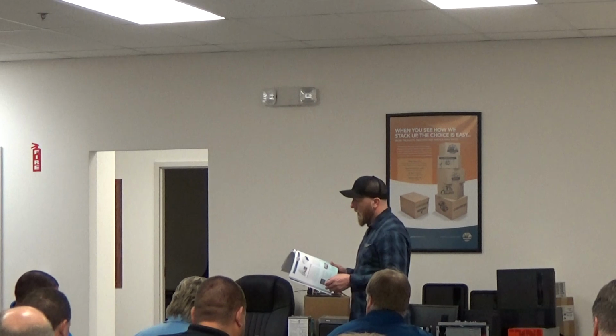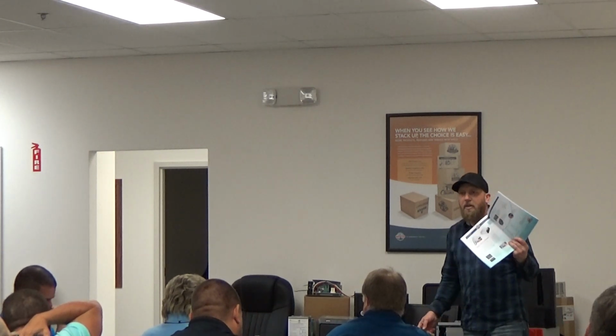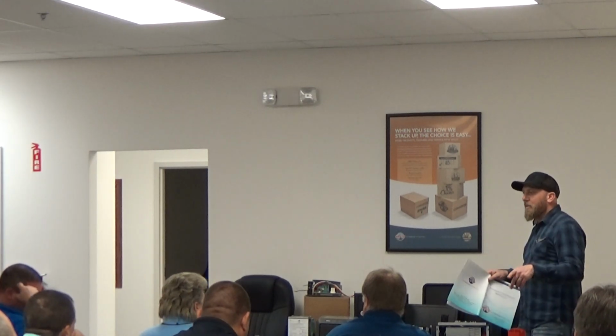Alright, page 34 and 35, we're going back to the 5110. Our 1000-watt inverter, I believe. I'm not sure if that's on your guys' OEM list as well, but there's quite a few OEMs that use our 5110 that you guys will see quite a bit of. The warranty on these is quite a bit less than what it used to be when we had the fake reverse polarity fuses, like everyone else, where if you hooked it up backwards it became a paperweight. Now with our actual reverse polarity protection, where you can hook the battery backwards and the unit be perfectly fine once you correct the polarity, warranty has gone down to almost nothing.